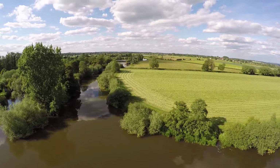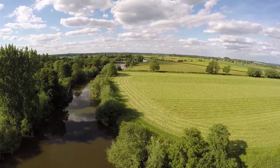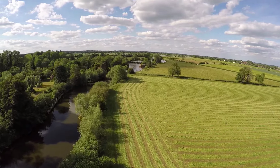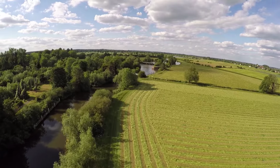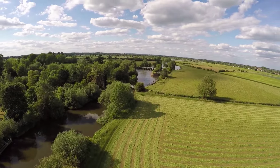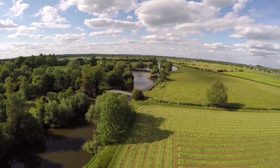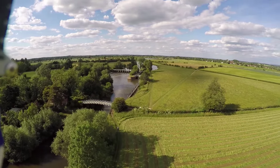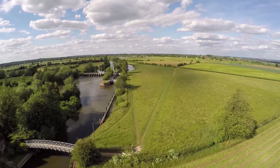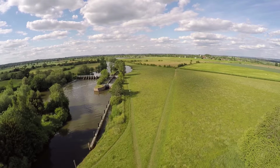And most importantly, I can be very negative about this, but I think there is a good gimbal lurking behind these, and as you can see from these shots, this is a perfectly usable shot. It's not perfect, it could be improved, and to be honest, worst case scenario, you could remove the dampeners altogether and hard mount this to a frame, and as long as you've got good balanced props and good balanced motors, I don't think you're going to have a jello issue.